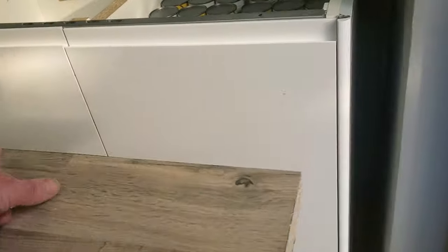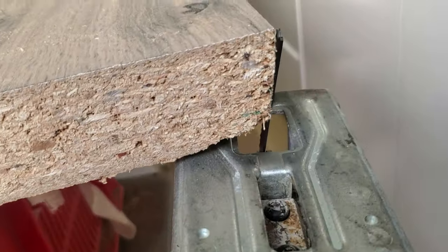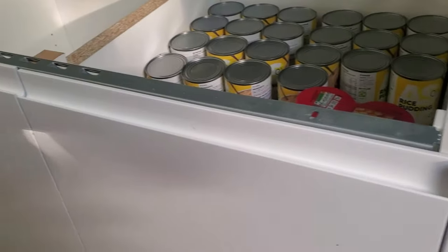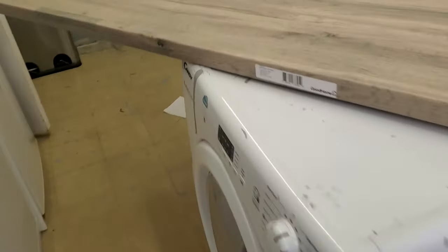You can see the real line there - see how crooked it is at the end, the way the wall goes. You always expect that from plaster - plaster hand goes out of the corner. There's a tiniest angle you want - just a wee curve on the tiny bit. As I got down to the end the handsaw wants to cut straight but I had to cut this crooked. The wood was going too far so at the end piece I just get a jigsaw, cut from the bottom up, cut a chunk off. It doesn't have to be much but it makes sure she's tilted in so whenever it goes to the wall the formica edge hits the wall - you don't want any wood sticking out. I'll slide this in now - one hand, no need to lift up a big heavy worktop.